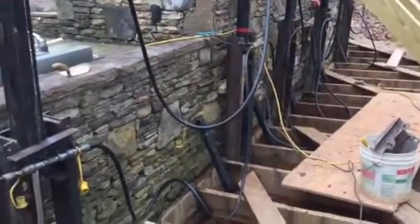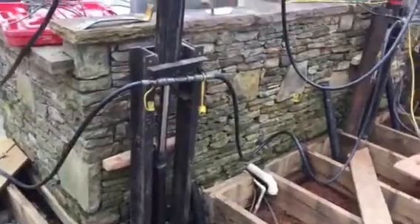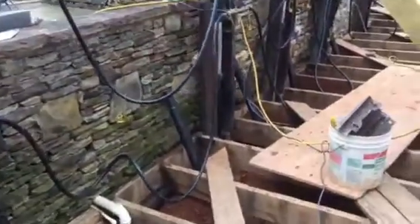This is a massive, about 22-foot outdoor fireplace and the whole backside is pretty much out of level. What we're doing is we've driven all of our piers down to a bedrock base, and so we're gonna try to jack this thing back up and see if we can level it.